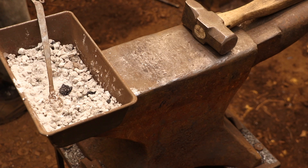The last bit of forging that I need to do to the legs is to forge weld a piece of hardenable steel to the inside faces of each leg. This is not absolutely necessary if you're just planning on using the dividers to measure things, but if you plan on scribing lines onto steel then a hard tip is really necessary, because otherwise you'll be sharpening the tips all the time.